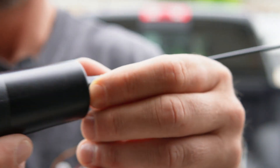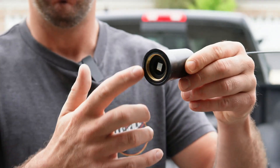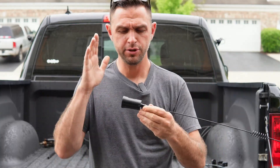When you get the Larson Antenna, inside the package there are multiple smaller packages, and within those you'll find little rubber washers to place inside or over the NMO mount, so that when you screw this in you don't get water or moisture inside the mount itself. Since this antenna is rated for up to 100 watts, it should work just fine with my Yaesu FTM 400. Let's hook this antenna up to the truck and do a couple readings to make sure the SWR looks good on both UHF and VHF, then we'll test it out.